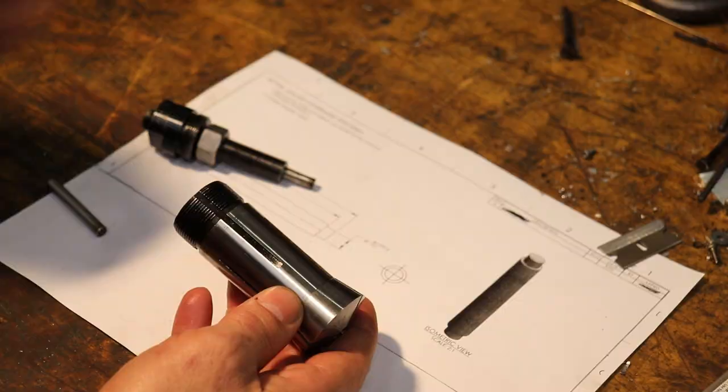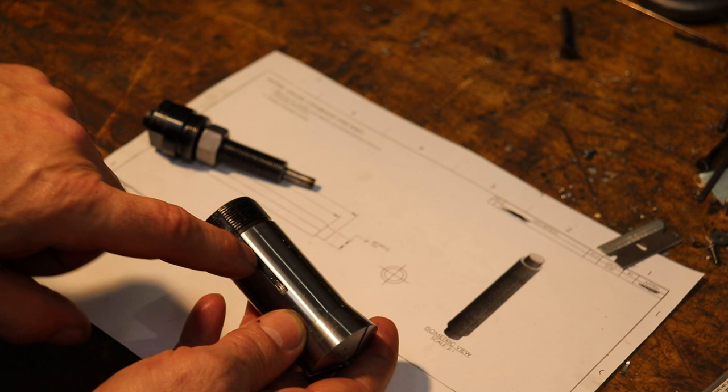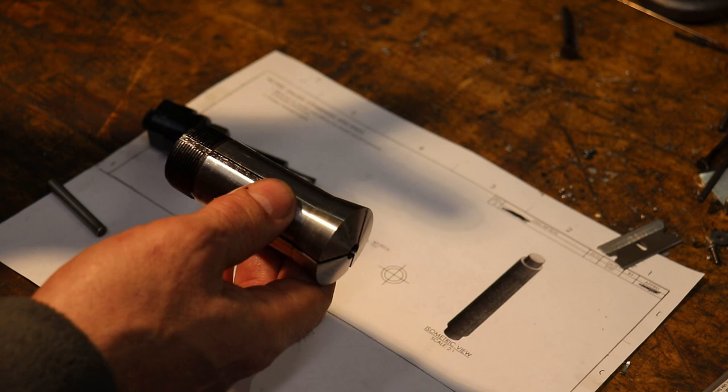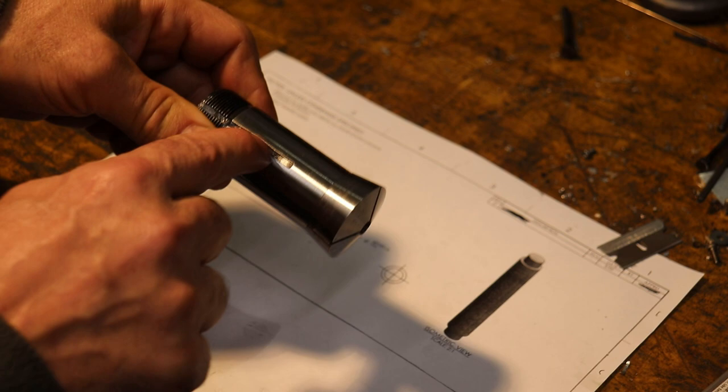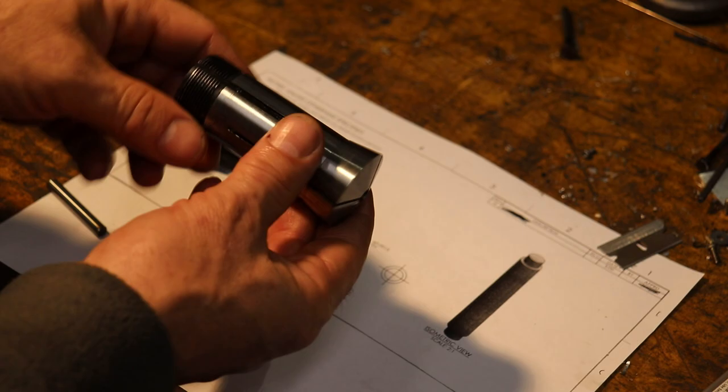And on the 5C collet chuck holder, there is a pin that is precise in diameter to this cut reference slot. So you can actually set the position of your 5C. This isn't very important for a free spinning lathe, but if you've got a lathe where the chuck is programmable for positions, then this is very important. In our case, our lathe doesn't do that. It just spins and stops. It doesn't have orientation capability, but a lot of the newer, fancier lathes do.